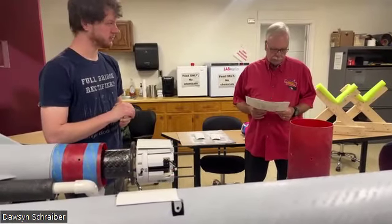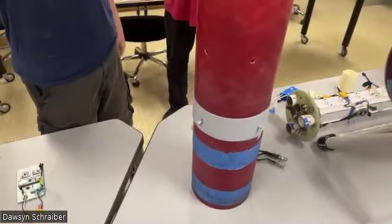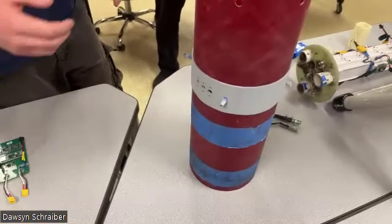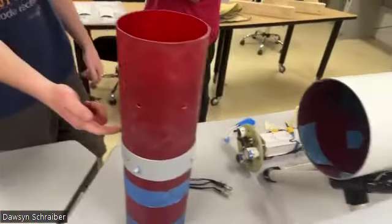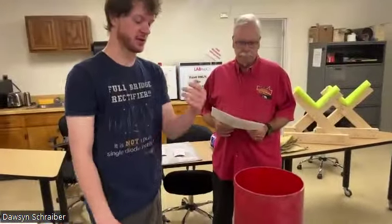Talk about couplers, material composition. So couplers are all Wildman fiberglass. Yet again, this one is the electronics bay coupler, the major airframe coupler in the middle of the rocket. So it has 1.5 calibers of intrusion into each airframe. It used to be a Spaceport requirement earlier in the year, but then it got changed. But we just kept it.